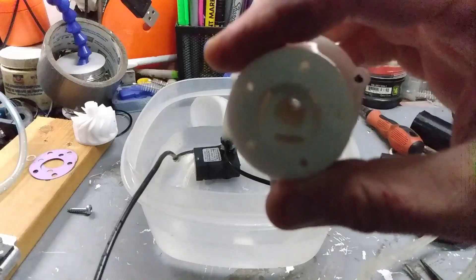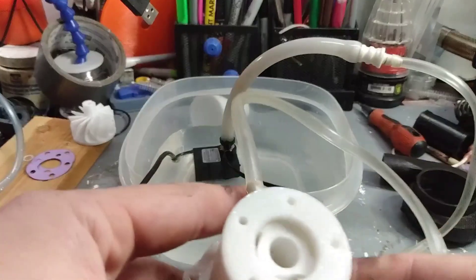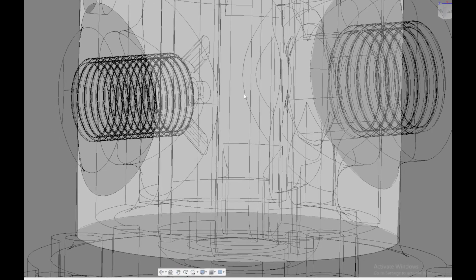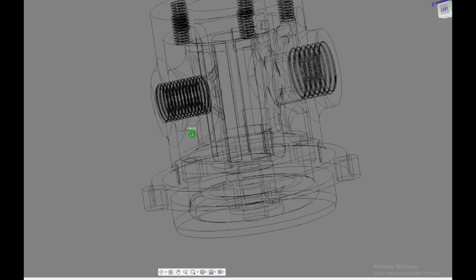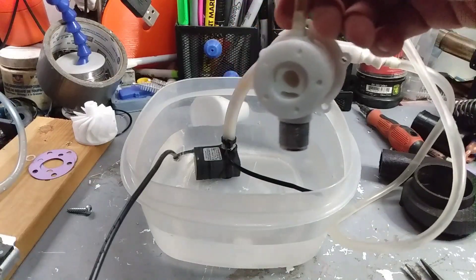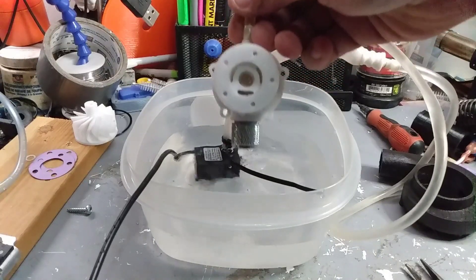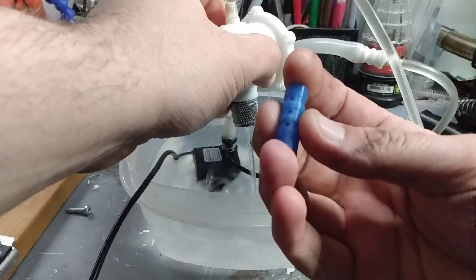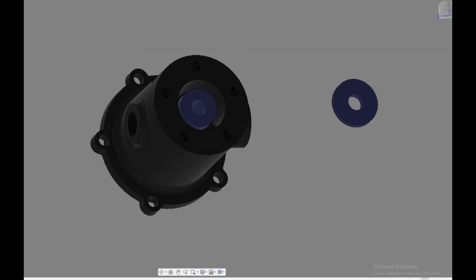In order to properly make this decision I decided to do some testing, which leads me to this 3D printed journal bearing. How this works: I made a bearing supported in a larger cavity with an oil or lubricant feed from the top that goes directly into the bearing center. The lubricant then leaks out of the ends of the bearing around the shaft, goes down into the bottom of the cavity, and leaks out through the drain port. For the housing I used PETG, and for the bearing itself I went with nylon.